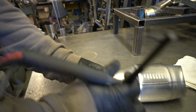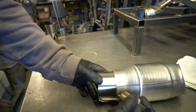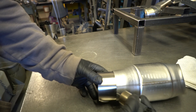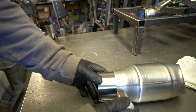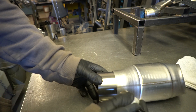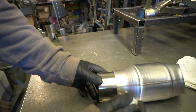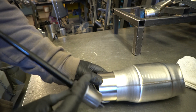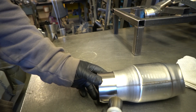As far as technique, I wanna show you guys. I see a lot of people and they wanna start at the thicker material going down to the thinner material. And if you weld this direction, what you're gonna end up with is a lot of chop. You're gonna see a lot of undercut basically coming out, because the material's gonna be wanting to fall. And it's really, really hard, even with adding filler, to get it to look real consistent. So the way that I weld these is I basically start all my heat on the 065 tube, on the thinner tube and on the lower tube.